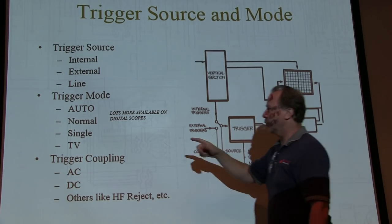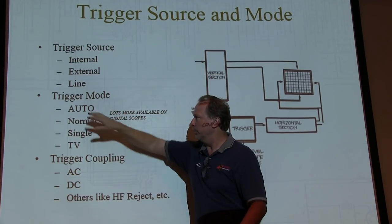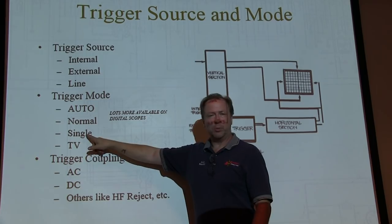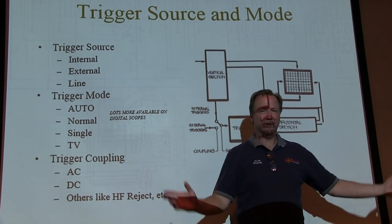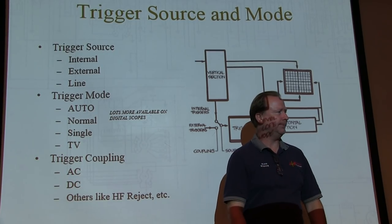So auto trigger is where you're normally going to leave things, okay? And you could use normal trigger, but most of the time auto trigger would be just fine. Single trigger you'll probably never use. It just sends a sweep once and then stops. It only is useful on these scopes if you've got a scope camera attached to them,